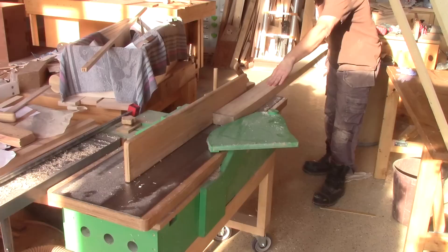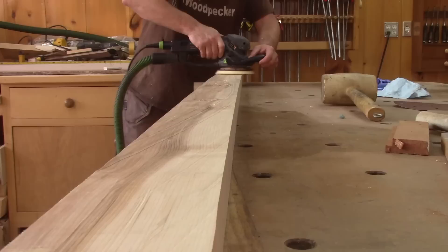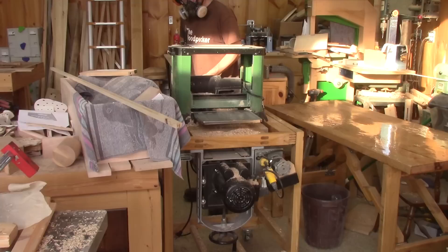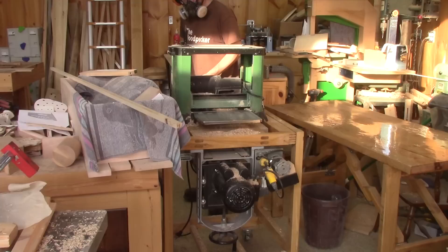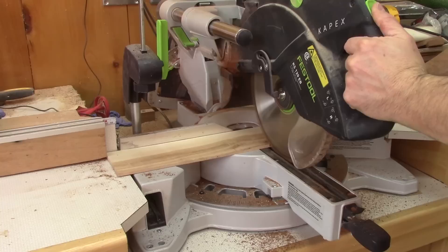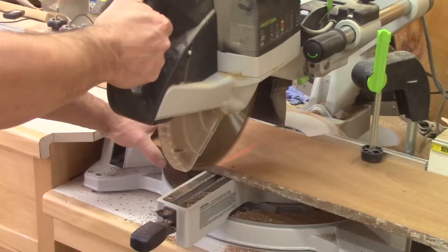But I'm not at all done — I still need four drawers. I'm going to use this piece of maple. After surfacing and sanding it, I rip it into three strips. I have two planks that will be used for the sides and backs. The thin one will be the bottoms of the drawers. The first thing I need to do is cut a bunch of small planks from the thin plank, then glue them together. I leave this aside for a while because I won't need it soon.